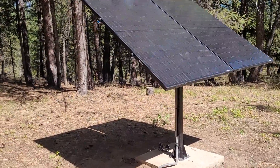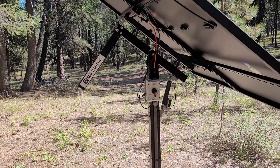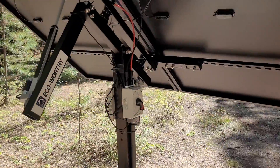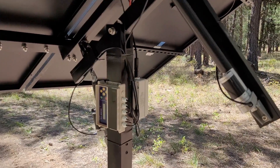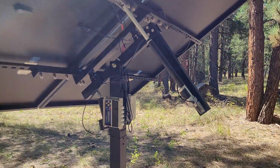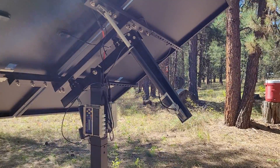Requirements on installation is just a 12-2 wire. I've seen people add an extra battery to this, but I don't know why you wouldn't just run a wire back to your battery bank along with the panel wires to power this system. I just ran a 12-2 back to my battery bank, hooked it in with all my other 12-volt products, and fused it.